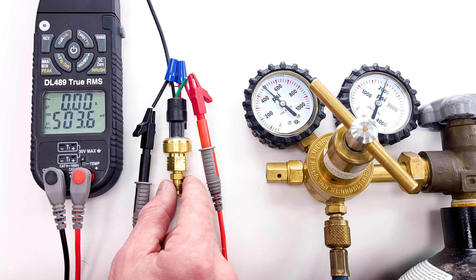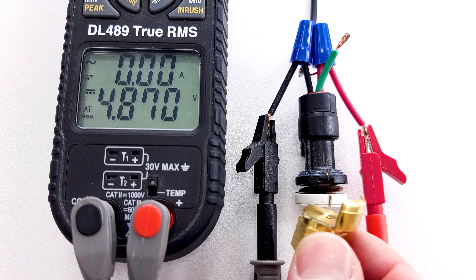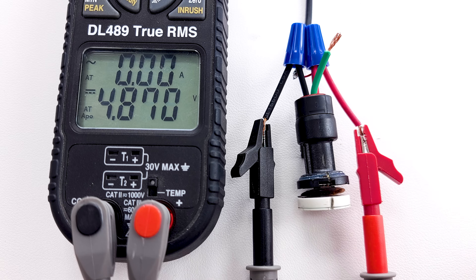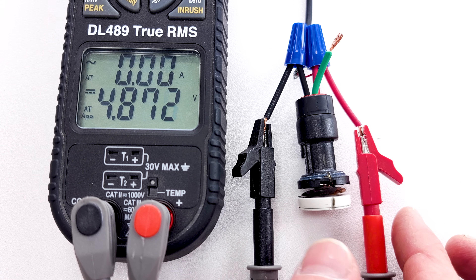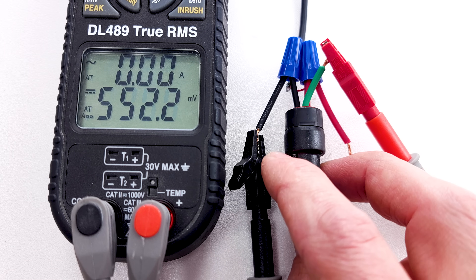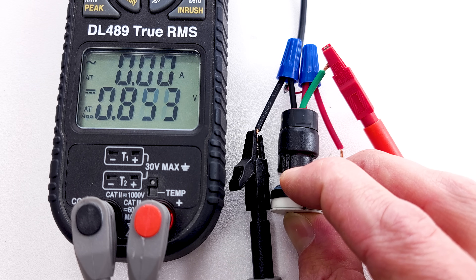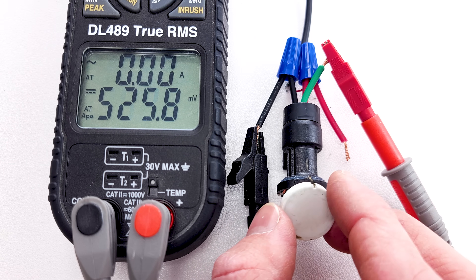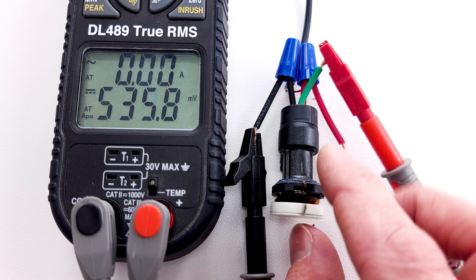You could also have a cut wire or added electrical resistance in the mechanism, or it could simply fail outright. Now I want to cut this open and take a look at what's inside. Here we have the bottom section — the body cut off. This is the brass section where the pressure attachment connects. Here you have your ceramic section, and this ceramic disc is resistant to alcohol, acids, and refrigerant oil, preventing them from affecting the sensing material inside.